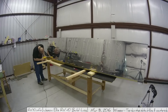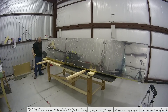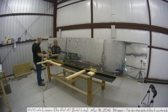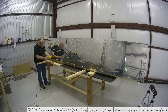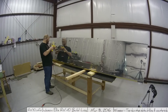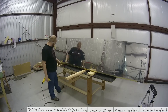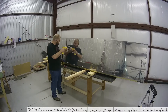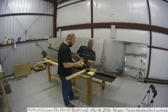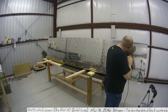After removing the bluing, I started putting the skin onto the wing itself and began the process of drilling all the holes along the centerline, getting it all clecoed up and making sure everything lined up correctly. There's something like a thousand holes on this side of the skin that you have to drill, dimple, and ultimately rivet. You can't rush this process - it's going to take days, and in fact it did. I can really appreciate why you do the left wing and then the right wing later rather than both at the same time - doing both simultaneously would probably drive you insane.